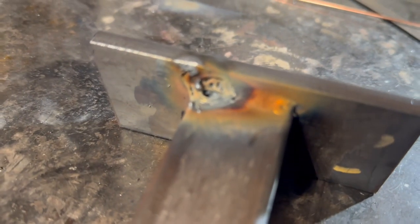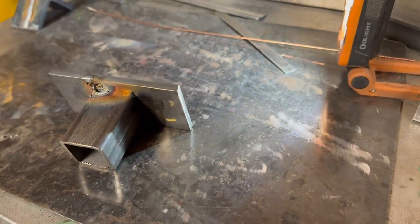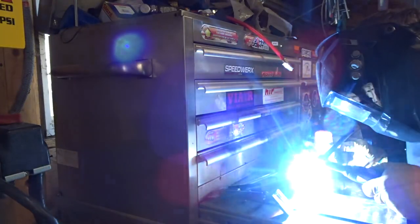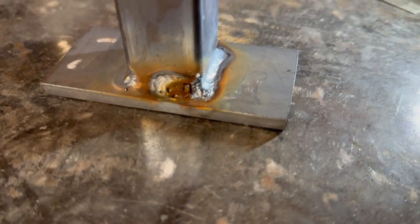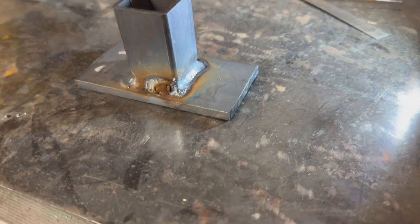That's the part I don't get — you're going along just fine and all of a sudden the metal just blows right out. I've got to grind that out. I tried again, ground it out, still contaminated. I'm going to bust out the MIG welder and fill it in.